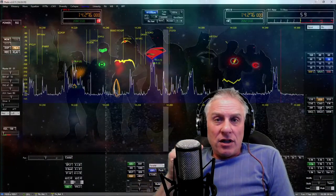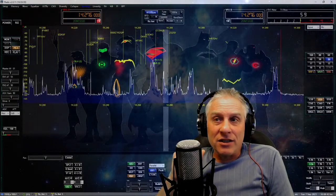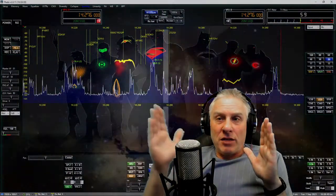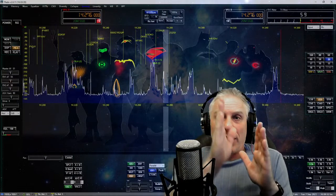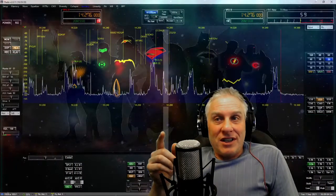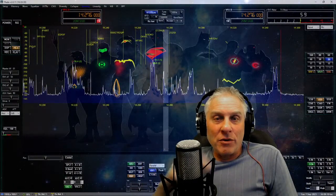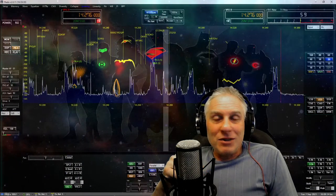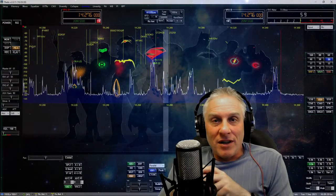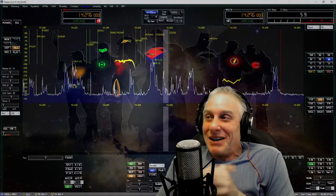Well, the problem with a loop is you put a loop inside of another loop inside of another loop, and I swear to God, it creates a Faraday cage effect. And I think the only way to get that to work is to stage each element outside. You see what I'm saying? So if you got three loops, maybe it doesn't work. What ended up happening was you'd tune one and get it bang on, and you go to the next one, start tuning it, and throw the other one out. It was a cluster. My friend Paul, WAB, worked on it. He basically picked it all up and threw it in the storage bin. He's a lot better with this stuff than I am, so I couldn't figure that out.